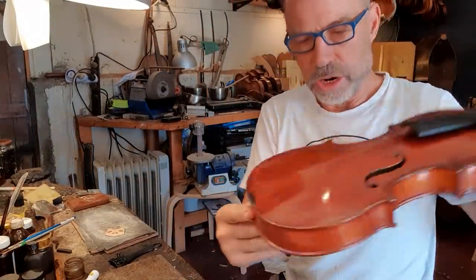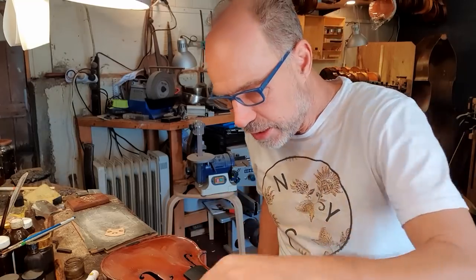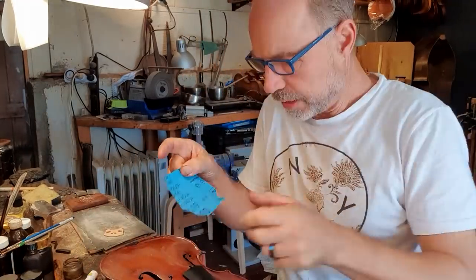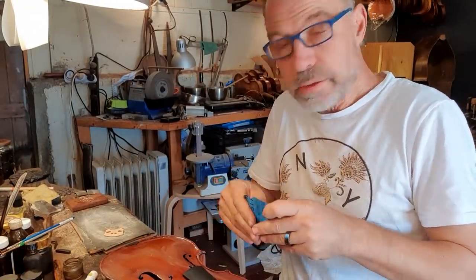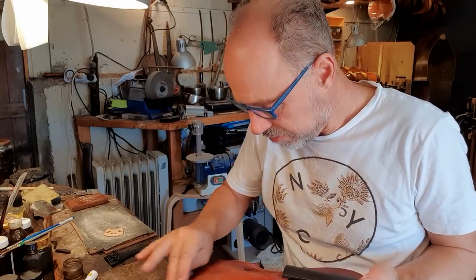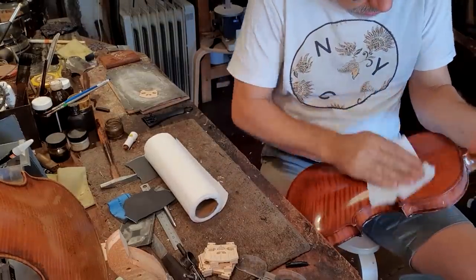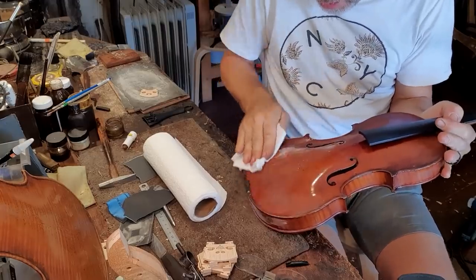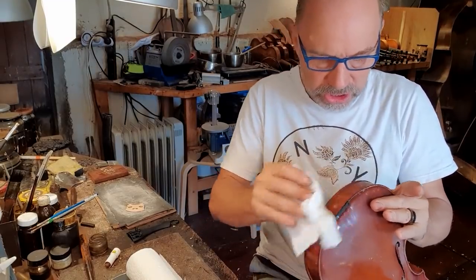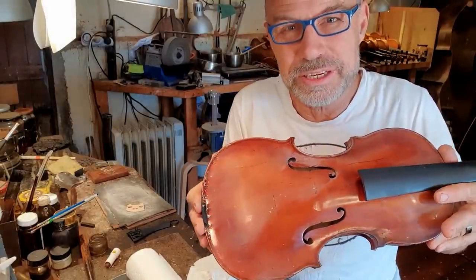I've waited a little while. This is now dried and I've sanded it and put another coat of varnish on. I'm gonna re-sand it — I'm gonna use really fine sandpaper, 800 grade. I'll sand it with a bit of water and then I might do another little lot of cover varnish. I've just got to wipe all the dust off, and then as soon as these areas dry I'll probably do a final coat of varnish, and once that's dry I can just polish everything. It's looking really good — very happy with the way it's coming together.